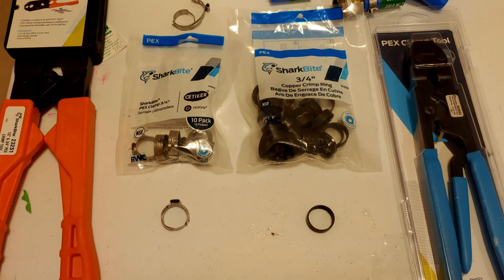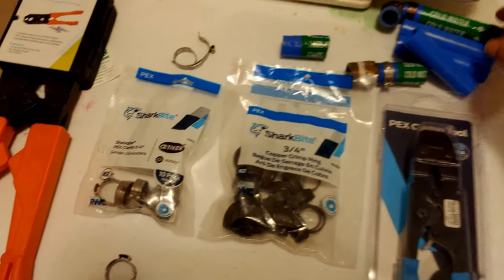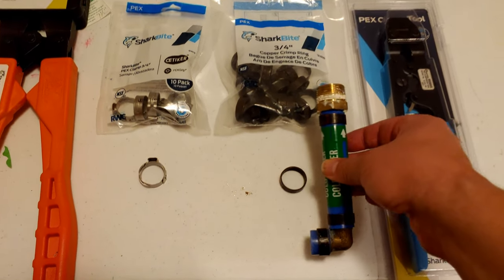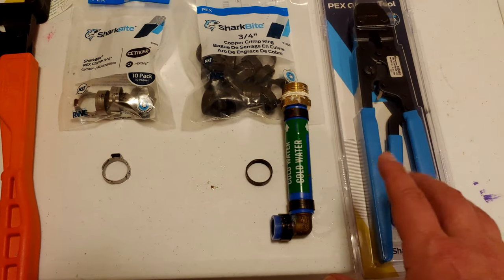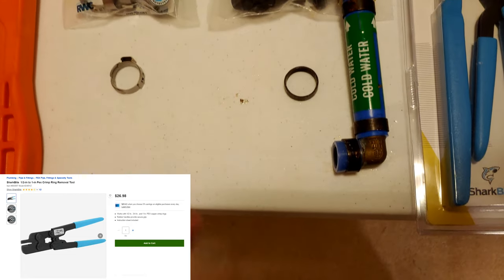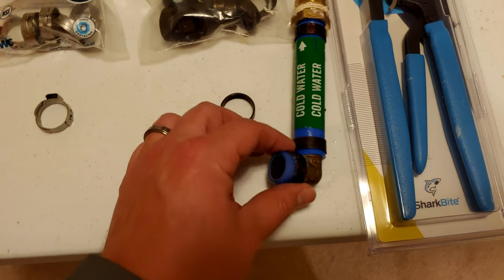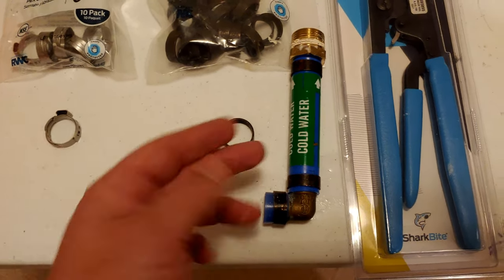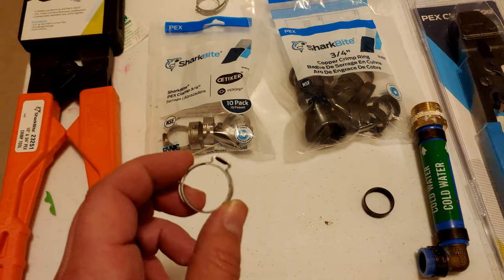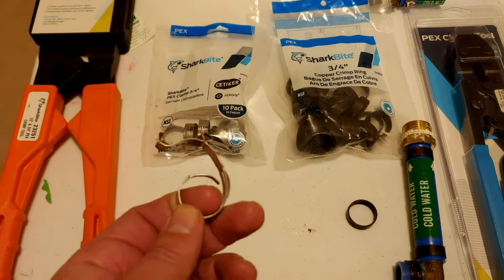What I really found to be one of the big differences is removal. Inevitably plumbing has issues, or maybe you made a mistake and need to redo it. This is a piece I took off from a cold water line. There is a tool — not shown here — that goes in from the cutoff end and cuts the copper ring in two places so it comes off. That tool is about $25 to $30. The trick is you have to come in from an exposed end, like an alligator jaw.